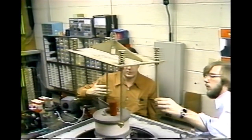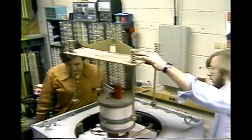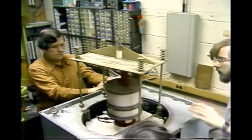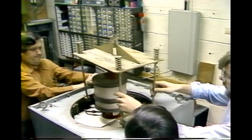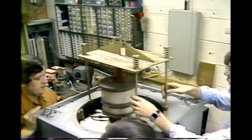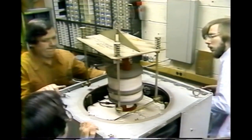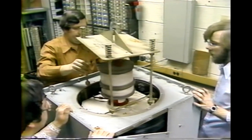We then lower the lifting frame. And after a last visual check to make sure that there are no protruding tuners or other parts, we can lift out the klystron. The klystron and cavities attached will lift out, leaving behind the five magnet coils inside the frame.